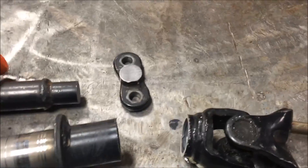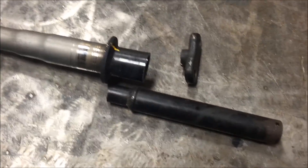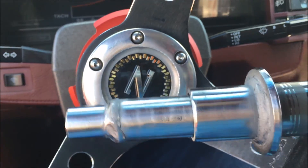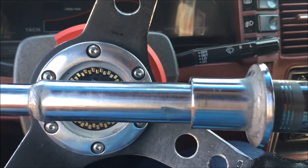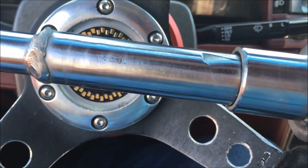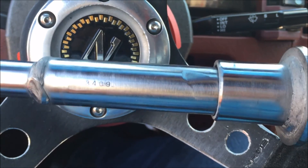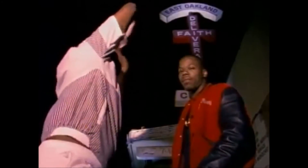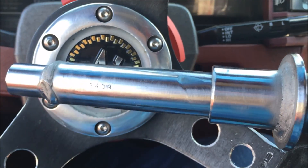So here's what I did — I went ahead and cut this end off and cut the u-joint off. First I'm going to sandblast it. This is where I'm at — I cleaned it up and I just put it in there right now just to hold it. But I'm thinking I'm going to go the other route and make a little adapter cup in between the two to connect them, that way it's not too short. I'm going to go down to the metal supply and buy a little chunk of steel.